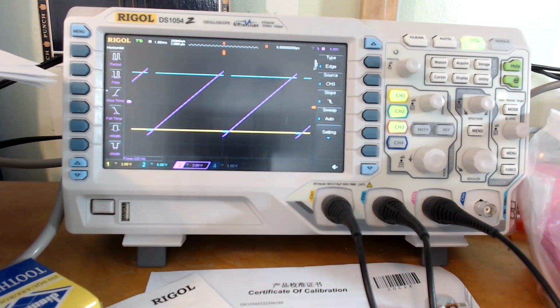But this is where things get messy. A lot of other VCO designs use fixed voltage limits at the 2 ends of the pot, which would be easy enough to increase if you had to. But in this design, Wilson designed a couple bits of circuitry that are essentially sampling and holding the extreme values, the maximum and minimum of the ramp wave, and he's using those as the voltages for the pulse width pot. Now, I don't know why Wilson did this in such a complicated way. I presume it's to avoid having pulse width fluctuations if the amplitude of the ramp wave fluctuates.